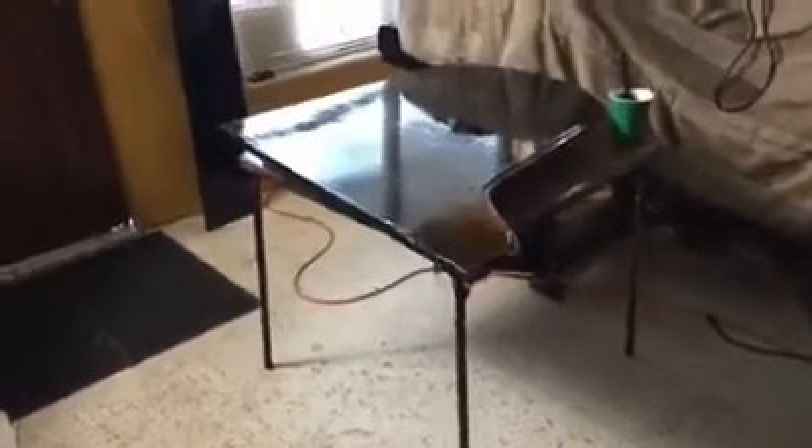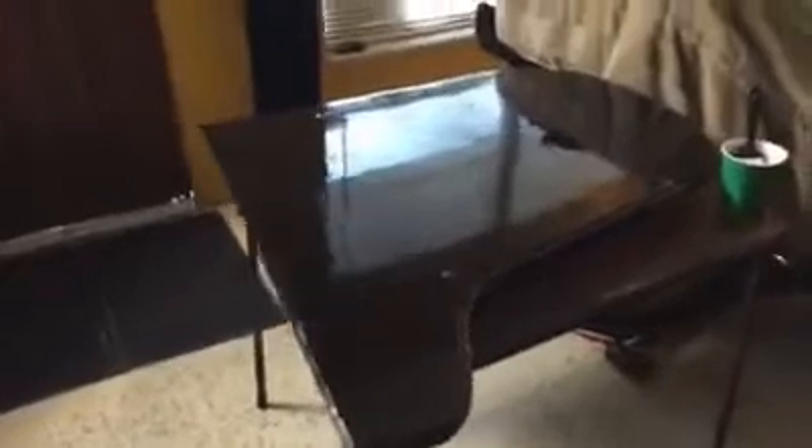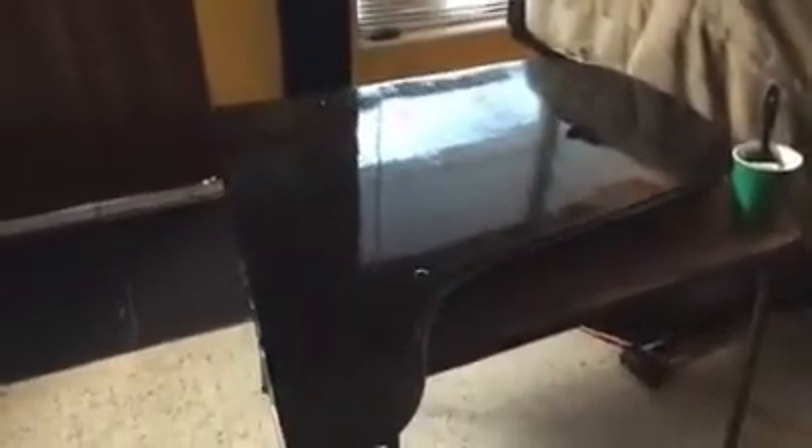But here's the lid right here and it's drying. You can see it's gleaming. I have to put a couple more coats on it. It looks a hundred times better than what it looked like before — before there were wavy spots, it just looked terrible. I didn't like it, so I took the whole thing apart and wet sanded the hell out of it. It looks ten times better. I wet sanded it and just took my time on it.